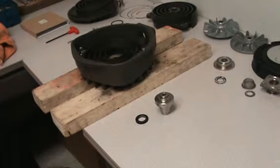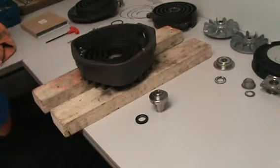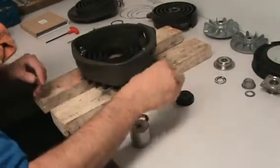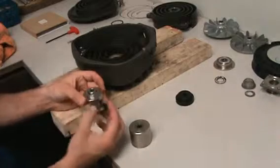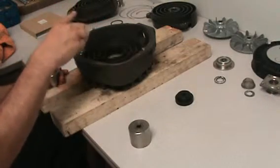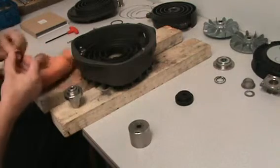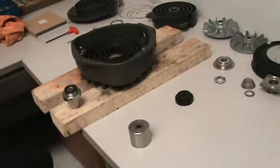All right, parts, fixture 1, fixture 2, fixture 5, and put the shaft seal back in. And this is where orientation matters. Now make sure your seal's facing the correct direction. Basically, you want the closed face facing in towards the high pressure chamber. So it sits right on there. This part requires Loctite 242.